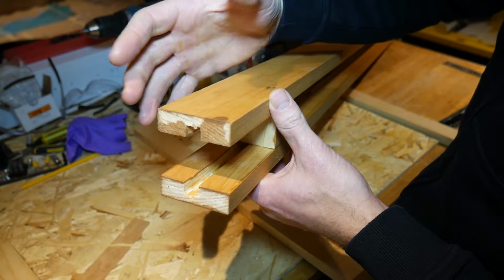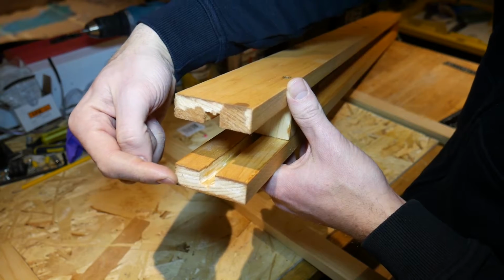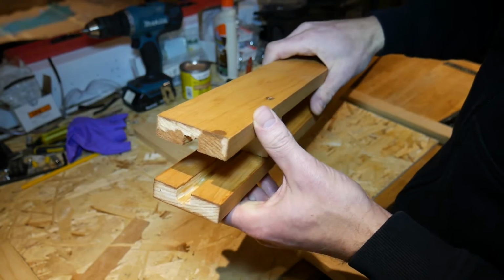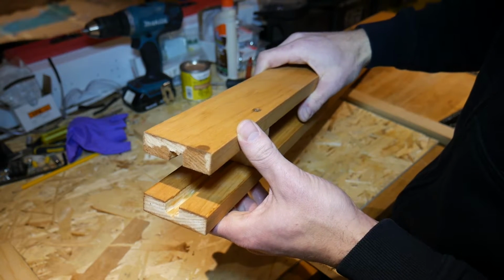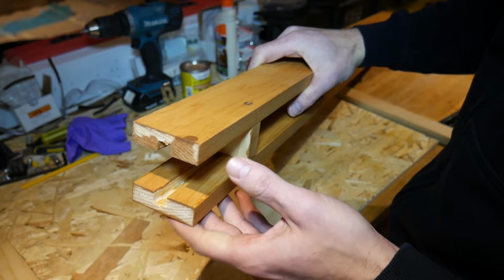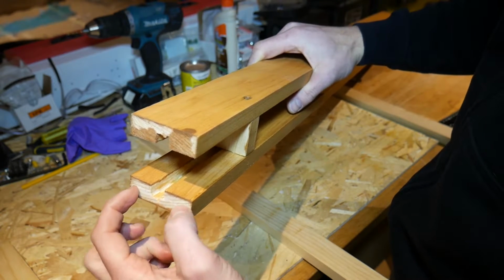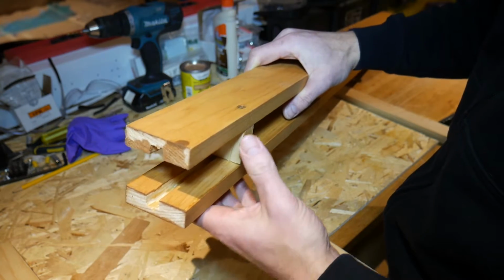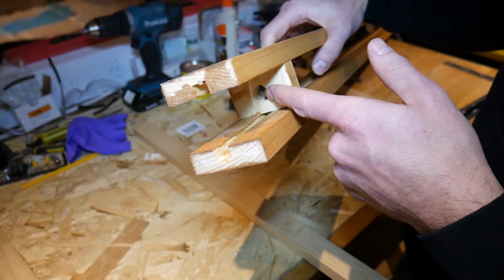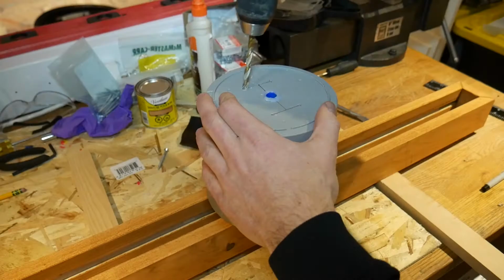And we're gonna need those measurements because we're gonna transfer them to the bottom of that gray pot. We're gonna be using 4 wood screws, one here, here, here, and here, to secure this to the bottom of the pot and hold it straight up and down with respect to that pot. So we're gonna be drilling 4 clearance holes in the bottom of the pot, and then 4 wood screws will go into the bottom of this piece, holding it in place with our PVC tube passing through this clearance hole that we put in the center of this piece of wood.